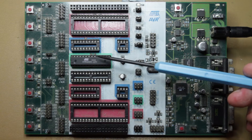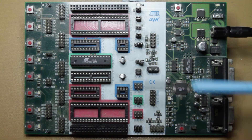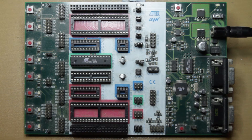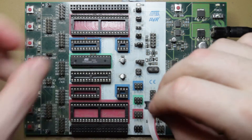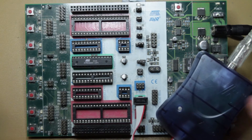Once you've picked the right socket, look at the colour around it — this one's green — and then look for the programming header, so this one's also green. So it's pretty simple: just get your AVR ISP, put it in the green one, and you're done.